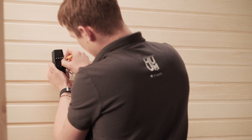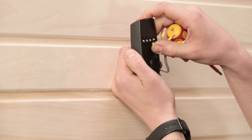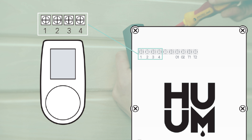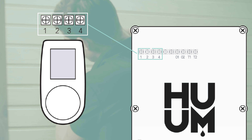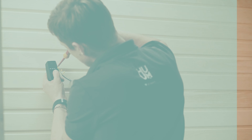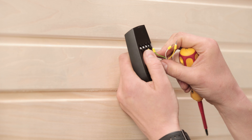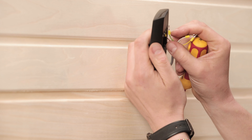You need to secure the wires to your wall-mounted controller. Just make sure you carefully match up the right numbered cables. This is the most common source of the problem when people think their heaters might not be working. In some controllers, for example, the numbers run backwards, which some people don't notice. This work is a little bit fiddly, but we've added these wire sleeves to help.